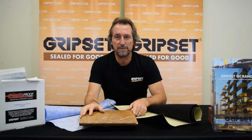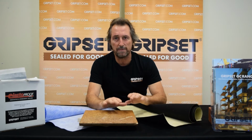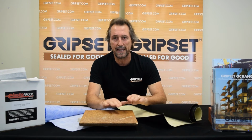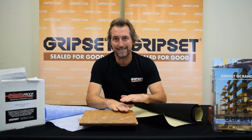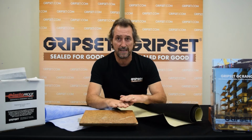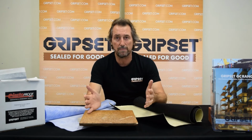Tilers or waterproofers must make sure that they've put some sort of cement sheeting underlay down on top of that flooring before they go and lay tiles or waterproofing over the top, to ensure that it is isolated from the surface. Otherwise, the particle board or timber will move and flex and compromise your finish.